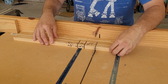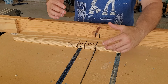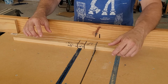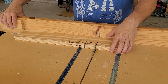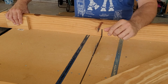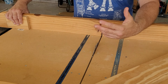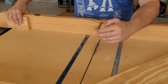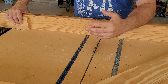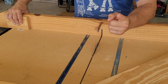Just be careful not to put pressure against the side of the saw blade because it will throw your measurement off. Once you have the jig in place, secure your stop block. Then remove the jig and now you're able to make repetitive cuts at that distance. Not only is this going to save you time, but it's also going to help maintain consistency, giving you a nice finished product. That is tip number one.